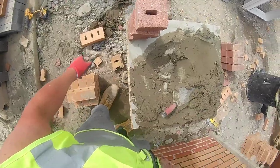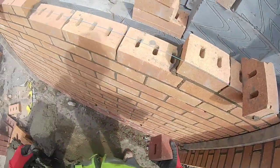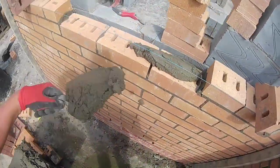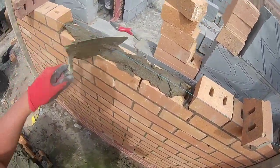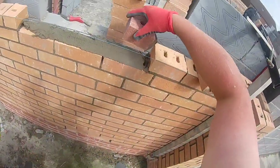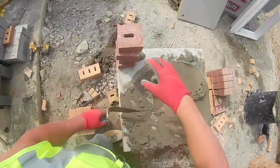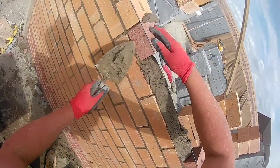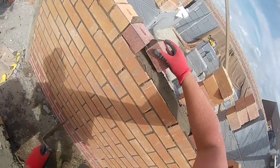If I'd had more time to get a house and not gone backwards about it, having a kid first and then getting a house, I'd have probably got detached. But this house type is quite easy to build, really. I've not found any difficulty on this Gleeson. Just a nice build. I like that everything's brick and block, even the gables. None of these spandrel panels or hip roofs. I always found hip roofs a bit more of a faff, making sure the pitches were right and whatnot. I like gables, I find them just like a straight wall.